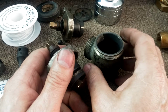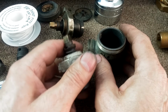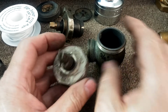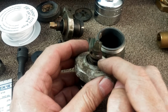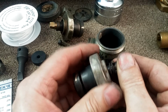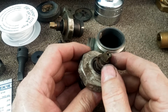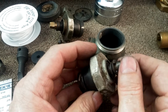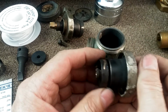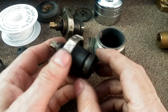The Trane company recognized the weakness of this design pretty early on and made a major improvement. Now this, by the way, this spring packing, they call it a packless valve, but it really isn't. They tend to lock up. They still make this type of quote-unquote packless valve today, and it just takes a little bit of leaking around the packing, and these things just lock up, and they can be a real challenge to deal with.